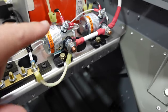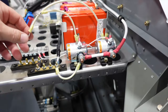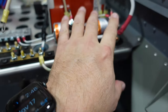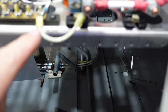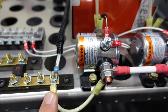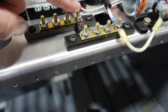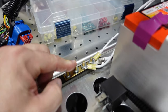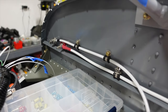Here we can see those diodes soldered up — those are in place. We've pretty much got power sorted out here. These positives will be jumping over to the batteries — battery one and battery two — solenoids installed, battery wires landed and ready for panel input wires. We've got our main power bus powering the dual-wired ECU wire directly, with a 30-amp fuse jumping across to power another bus. On the opposite side, we have our negative bus with two negative ground wires going directly to the battery along with a negative wire running to the negative terminal on the pass-through.